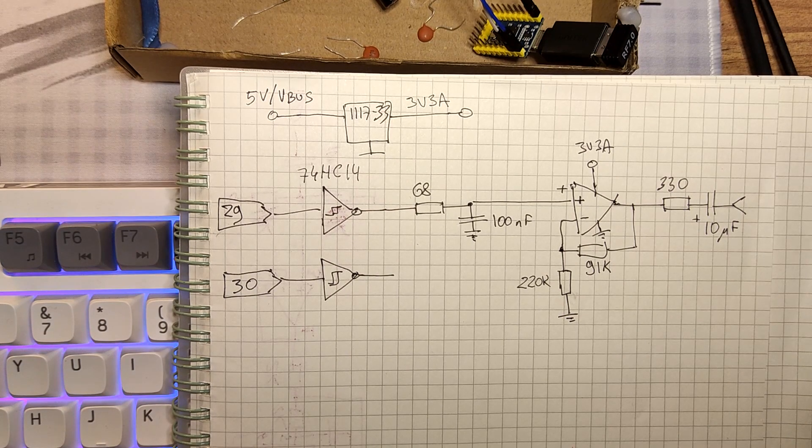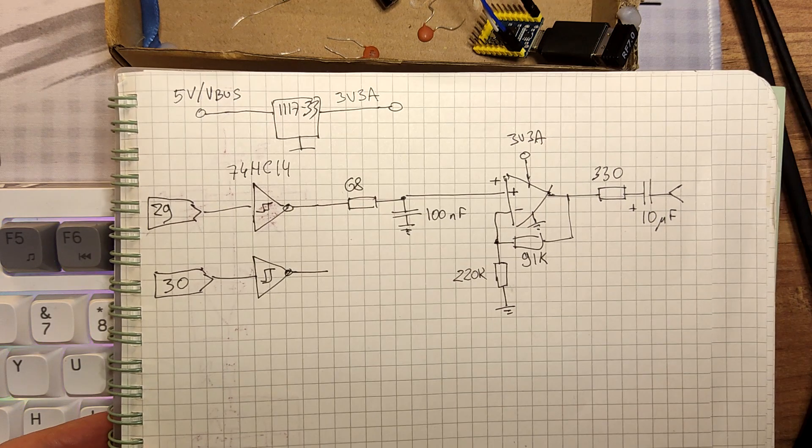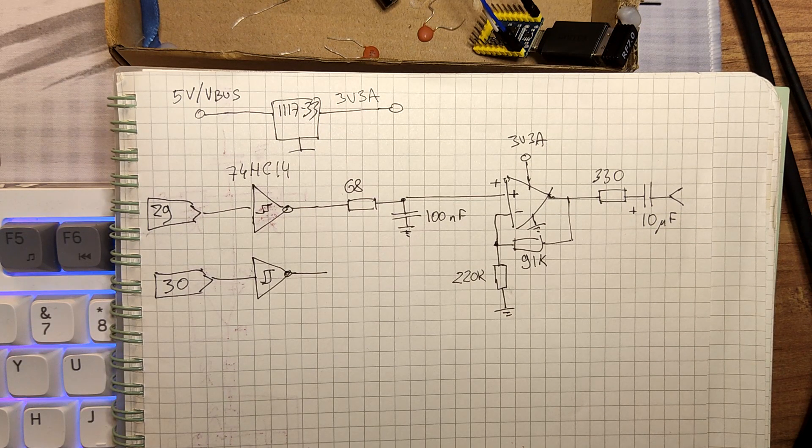I looked around and the general idea was that you just cannot have a clean output if you use PWM. But actually you can. The thing is, you just slice your power lines using the modulator. So if your power is dirty — and power lines on these FPGA boards tend to be extremely dirty — you slice dirt, and no matter how much you filter it, you get the same noise.